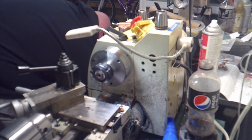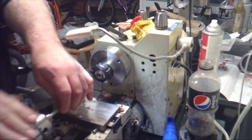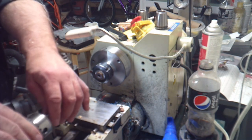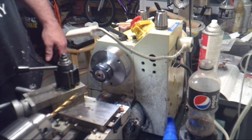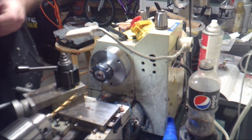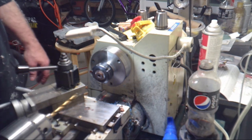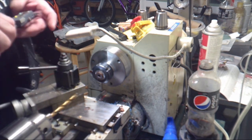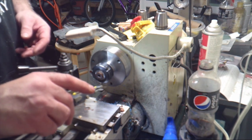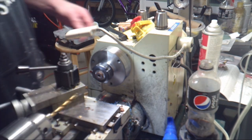And that's going to be from the shoulder of the drill bit, not the point. For double checking the measurement, I actually mark a line with a Sharpie on the drill bit, so there's already a line there. We're going to check it, and then you'll see me grab a nib, and we're going to measure the distance from the lip of the housing to the start of the threads. And you want to measure in a couple threads, because remember, as you screw that housing in, the wider part of the housing is going to sink in.